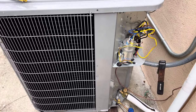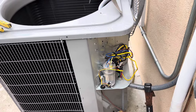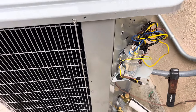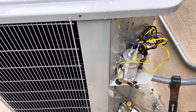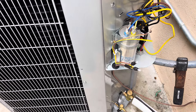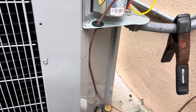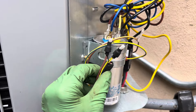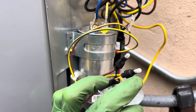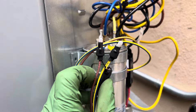We're out here on somebody else's install, so pardon the things that don't look so good. He's a general contractor who doesn't know anything about heating or cooling — learning the hard way. My son got rid of the five feet of loopy wire loop and redid the wires. Remember: when you put your wires together, put your caps on, twist them many times, and put your heat shrink on them.